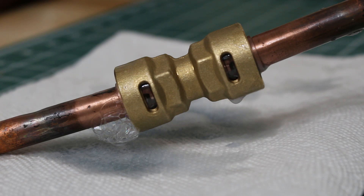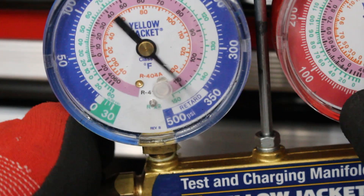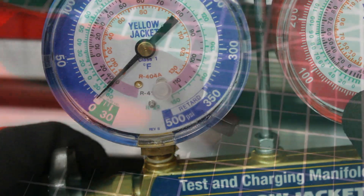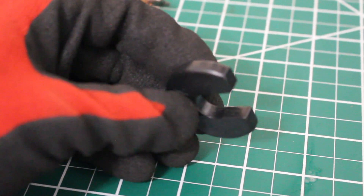That's what I said from the beginning — preparation is definitely going to be the most important part. This is a removable coupling, so I have the removal tool. I'm going to try to remove the part that's leaking and try to reinstall it the same way. If that doesn't work, I'm probably going to prep a new piece of pipe and see if that holds. The removal tool is sized for the specific pipe size you're using.